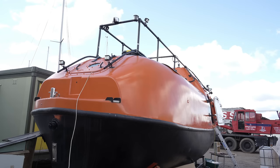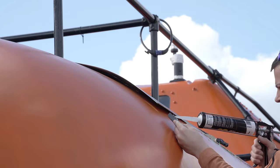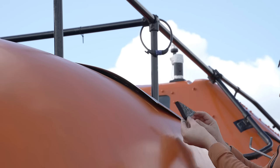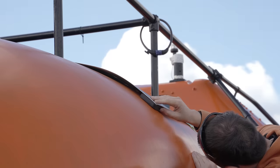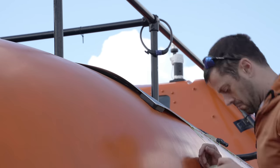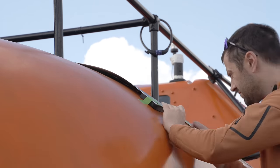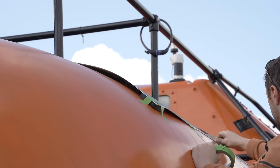I left you in the lurch over the port side pair of 100W solar panels. All panel sides, save for the leading edge of the front panel, are now securely bonded to Allen's fiberglass. This is the problem section where the boat curves away in two dimensions. I'm bonding a spacer into the corner — this is the right height so the panel isn't contorted — but I'll need to fill the gap and edge it with environmental seal tape or something similar, otherwise waves and wind will get involved.